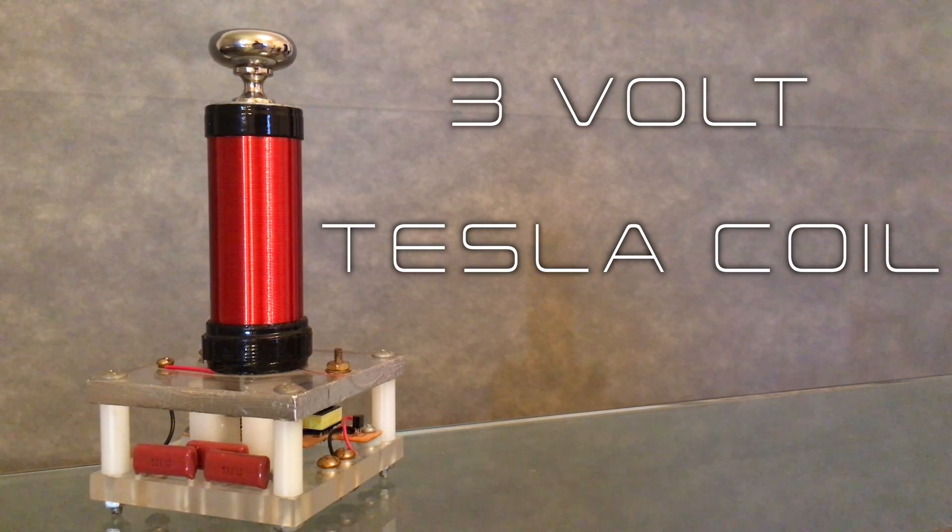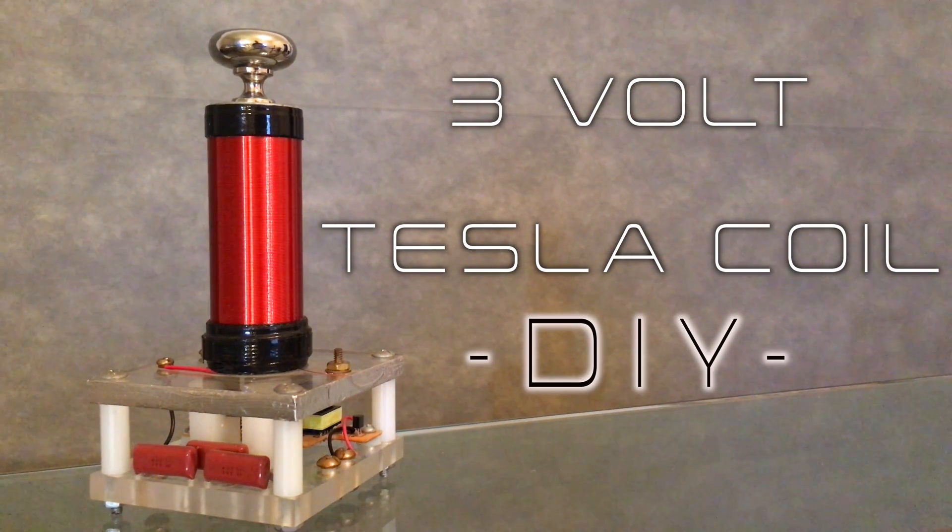When I applied this method of measurement to my small tabletop Tesla coil, I found it outputs about 30 kilovolts. Let me know in the comments if you'd like a DIY episode on how to build it. Honestly, it's that simple. There are more accurate methods such as using a voltage divider, but that kind of adds complexity and I prefer simplicity.